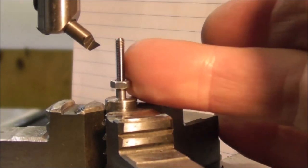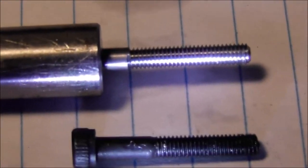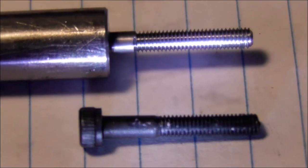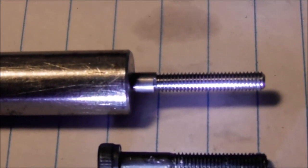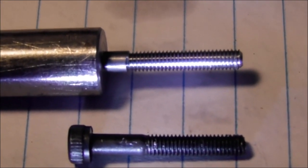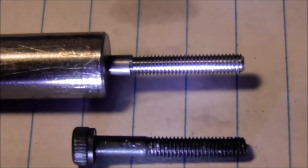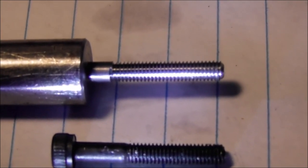The process of thread milling with a fly cutter on long slender work works better than I thought it would. You can see here there's a standard three millimeter cap screw and it will easily cut the length of a standard cap screw thread. I could have gone further but I would have needed to grind fly cutter clearance to safely get right up to the shoulder. That's another advantage of thread milling — you can cut right up to a shoulder without an undercut. When screw cutting in a lathe you need an undercut to run the tool into, but with thread milling you just wind the part in until you're almost touching the shoulder and you've got a very nice tidy run out.